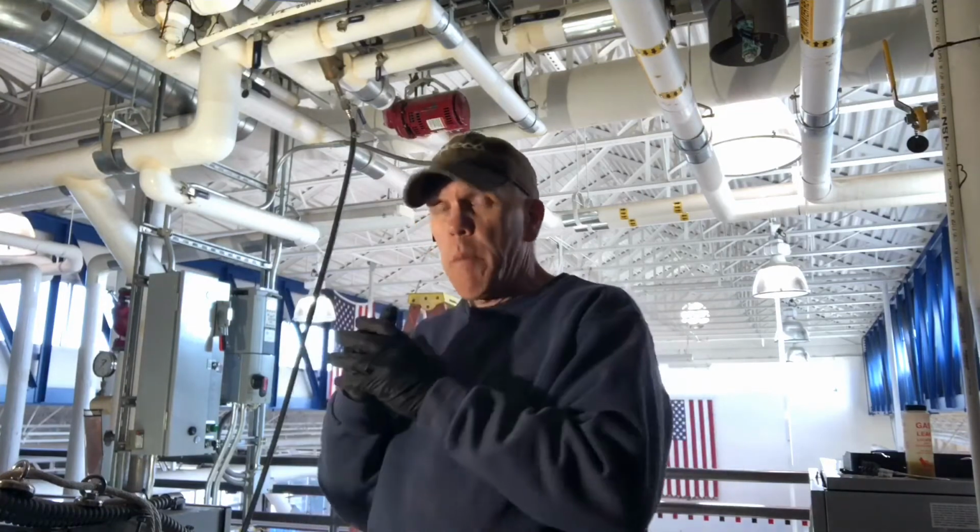Today I'm going to be pulling that Series 90 Bell & Gossett pump up there and replacing the pump seal in it. I'm not going to go through showing you how to replace the pump seal. There's plenty of videos out there to do that. What I am going to do is show you how I drop that motor and how I like to put them back up when I'm working alone.